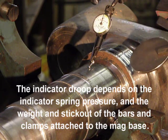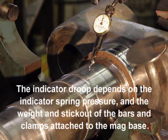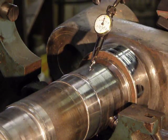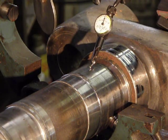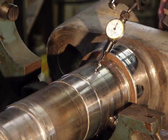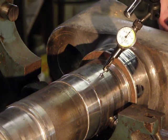Generally, you'll find that your indicator should read plus one when you're reading on the top and minus one when you're reading on the bottom, and then zero on the X and Y. So here we have about minus one. We're going plus in this direction.